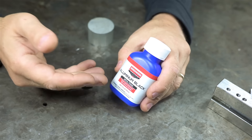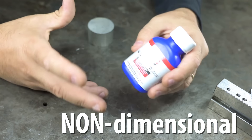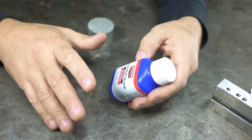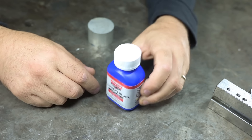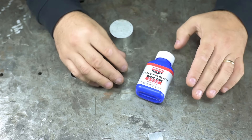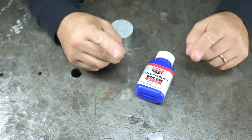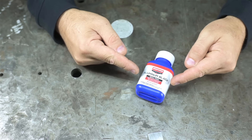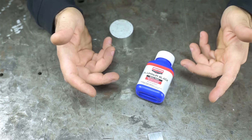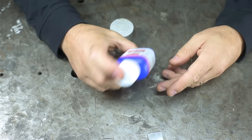Aluminum black. Despite the fact that I'm holding it in my hand right now, this is advertised as non-dimensional — meaning it won't add size to your part. I don't know if it oxidizes the aluminum, maybe pits it, dyes it black below the surface, or what. We'll see how it goes. So why have I been hesitant? I've always known aluminum to require anodizing to turn it black. I don't understand how a room temperature process could do it and not just wipe clean off. I've only really seen it advertised for small touch-ups — scratches, things like that. So there must be a catch. I probably could have checked online before spending my money, but I'm stubborn.